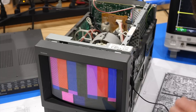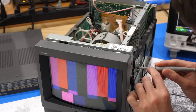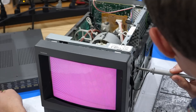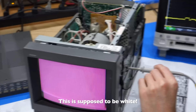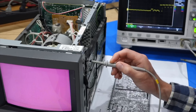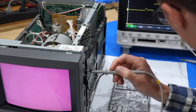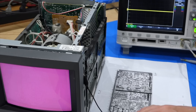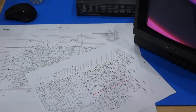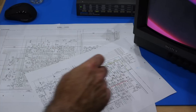Looking at components 149 and 152 — those are the middle pins here. I'm wondering where all the spikes are coming from. Here's the 100% color field. Those are individual lines. It looks like it's up around 4 volts. This is the same across channels. Let me check channel 3 — the input signal is there. So either it doesn't make it through the amplifier, or the tube is lazy. Looking at each of these amplifier stages, the current is the same.